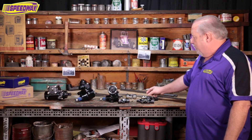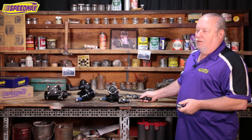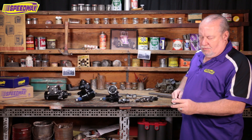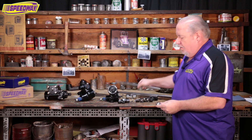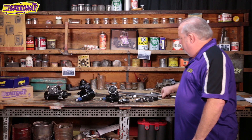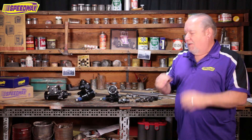One other thing here is our support heim. You definitely want to use a support heim if you're using three or more U-joints, or if you're using the double ones. The support heim is seven thousandths oversized, so it will slide very easily over a round shaft, and you can also slide it right through on the double D shaft. For those who didn't see the end of the double D shaft, the reason they call it double D is it's rounded on each end — just like you would put two letter D's back to back.